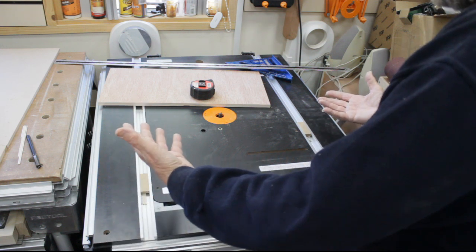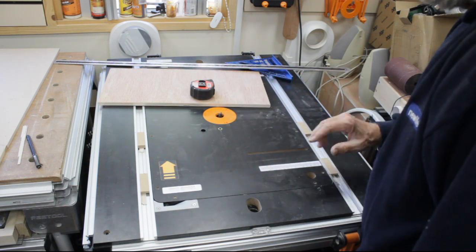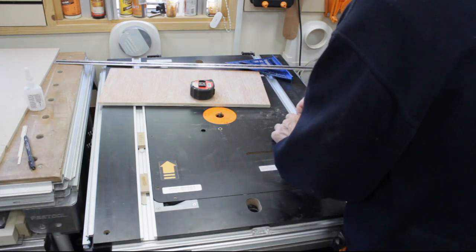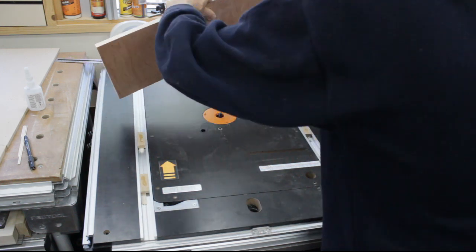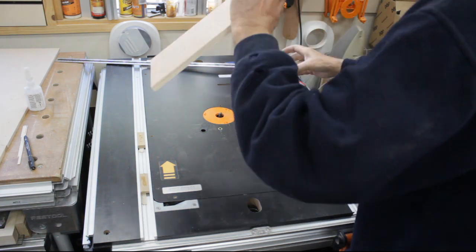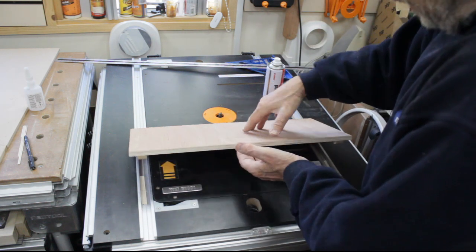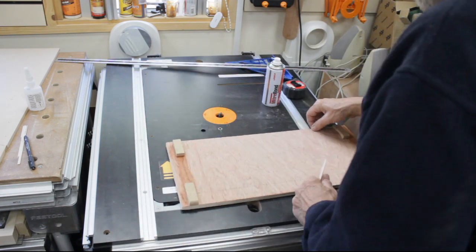and they'll be slightly protruding so that I can put some super glue on and then just bed it down on top, and then I can screw them in afterwards to reinforce the join. So those go where the marks are. Just spray the accelerator on the bottom and then centre it up. So that with any luck now, if I lift that up, it should bring up the spacers. That's it. Drill and screw those in now.